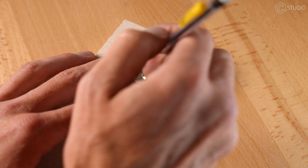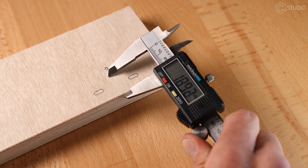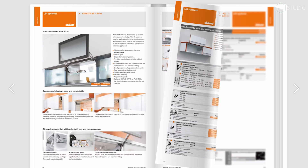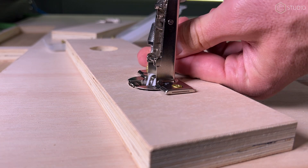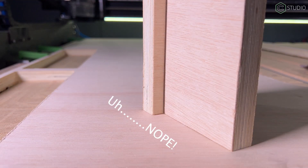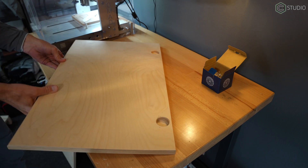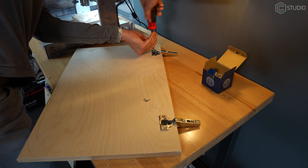When it came to figuring out the clips and the hinges, the clips were easy — I simply put them in position along the side of a piece of plywood, traced the holes, then measured accurately with a set of calipers, and was able to lay them out first time perfectly. With the hinges, it was slightly more complicated. I took my best guess as to where the hole needed to be located relative to the edge of the plywood, then measured out the mounting holes. Version one came up a little bit shallow on the overall hole, and I had to adjust the mounting holes as well, but it took one revision — I moved it a little closer, and that had it within spec of the hinge adjustment. Remember, these hinges are adjustable. With two versions, it came out perfect, and now I have that layout to use in all future projects.